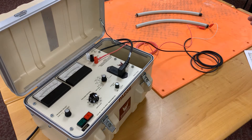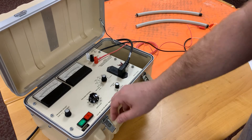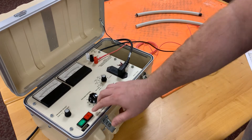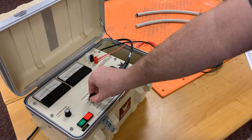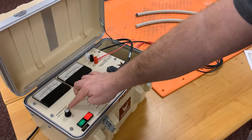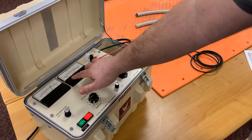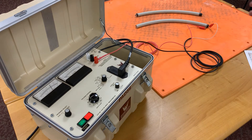We're going to do a quick test here on a couple of x-ray cables I have hooked up. The first cable is open on one end so it should not draw any current. We'll go ahead and turn the unit on — we are currently in 5 milliamp DC. Turn it on and raise the voltage. We are in the 3kV range select, right now at about 2kV drawing no current on the meter. This would be a completely zero fault cable.